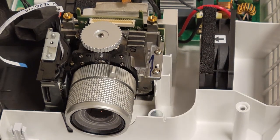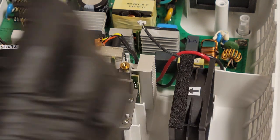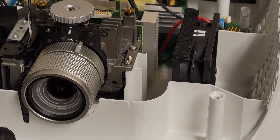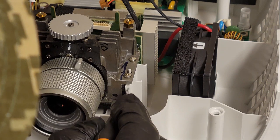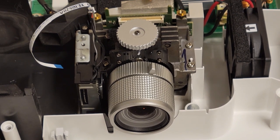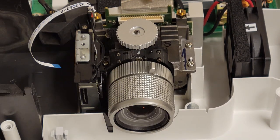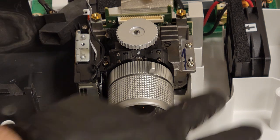Oh, it started to move. Little bit of a crack opening. I do wish I had heat shrink that would fit around that, but I think we'll be okay if I just use the CA glue to rebond it. CA glue melts the plastic and then lets it resolidify, and that's how it glues. It's kind of like a solvent. That's why if you put it on plastic, sometimes the plastic will get kind of squishy. It's not quite as solventy as toluene, but works pretty well. So I'm hoping that will take care of that.